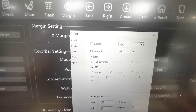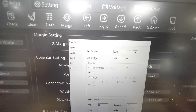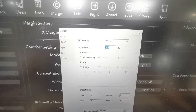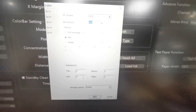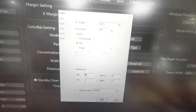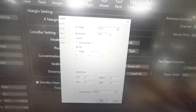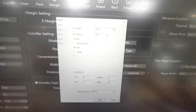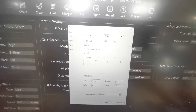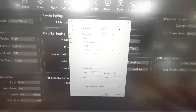If you have only two print heads — one for white, one for color — you just need to set spot one to enable and set the ink amount. You can choose white percent and set to RIP if you set the spot channel from the RIP software. Here is the blotting setting to cut down the edge of the white ink layer to prevent white ink overlap. You can set zero or adjust from the RIP software. This number cannot be too large — if you print a picture with small characters, it's better to reduce it to 0.1, 0.08, or 0.09.